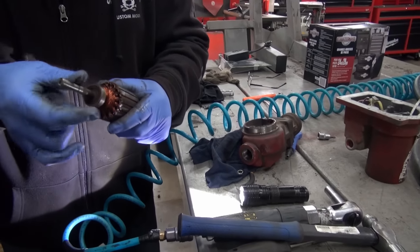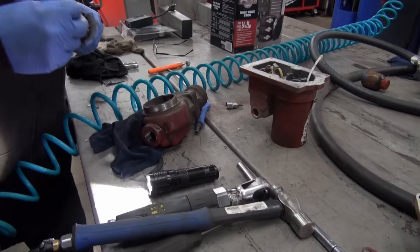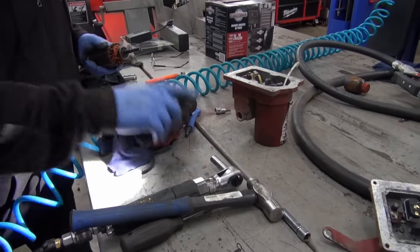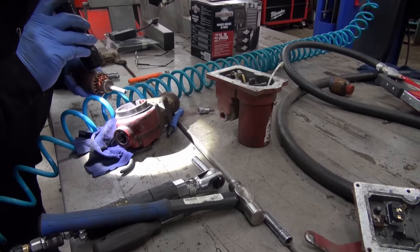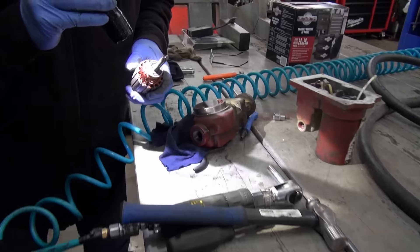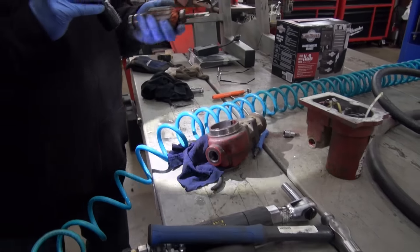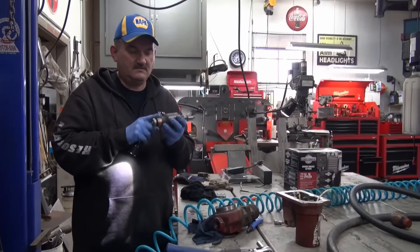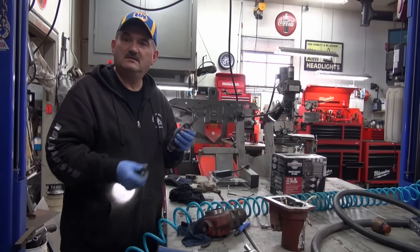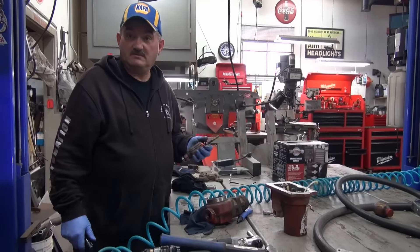The bearing is not good — no. That's not what stopped it from pumping though. Water must have got in there — look at that, it's kind of muddy looking. I'm going to clean all this up, turn it down on the lathe, set the brushes again, put a new bearing on there. Might be able to save the pump — good for a spare.